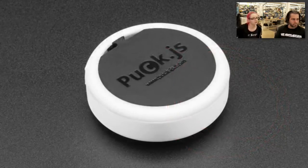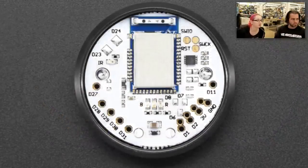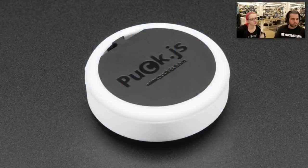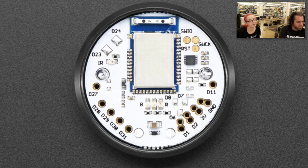And we just added this right before the show. This is a new product from Espruino. They finished their Kickstarter and sent us a bunch of these Puck.js. This is Espruino — it's JavaScript. Just like we have CircuitPython, which is Python, there's Espruino, which is an embedded JavaScript. In this case it's running on the NRF52832, which is the latest version of the Nordic Bluetooth chipset. It's a Cortex M4 processor with 64K of RAM and 512K of Flash. That little module is FCC certified. And it also has an accelerometer, RGB LEDs, a light sensor, a temperature sensor, and a couple other things. All runs off a coin cell. That Bluetooth low energy chip is really low power, so you get JavaScript and Bluetooth.